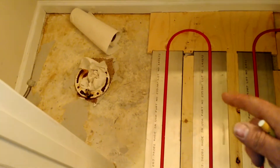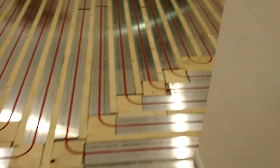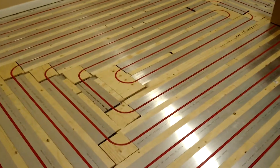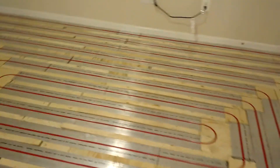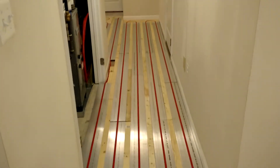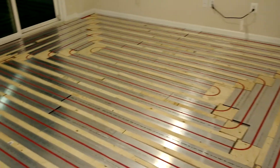I used several different kinds of loops here. These loops are probably the best way to do it — the floor will be as even a temperature as you can get, because your supply and return lines run right next to each other. Now, it's a little harder to do than running it the other way — you know, that goes down pretty quickly, no thinking really involved. This takes a little bit more, but it's a lot better, a lot more even floor temperature.